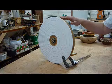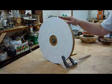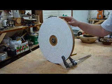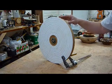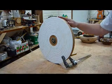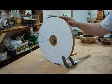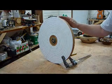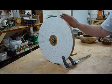Starting at the front of it is a piece of 1 inch MDF. I like to use MDF because it's very flat, it's very stable, and it's actually pretty cheap. Sometimes you can even find it as scrap material. If you're going to use plywood, I would suggest using at least two pieces of 3 quarter inch ply glued together. You want something very rigid, very stable — you don't want any kind of flex in this.